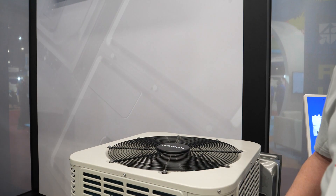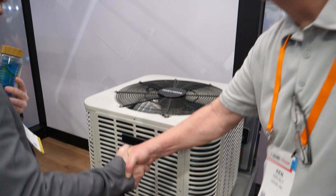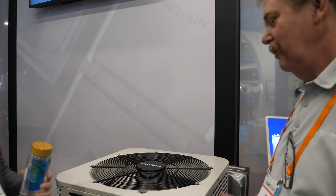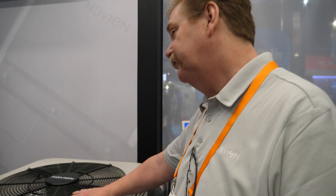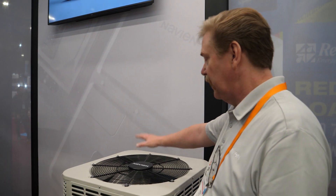The heat pump is brand new stuff for us — we're just starting to get into that. It'll be coming out early next year as our target. With that heat pump, Ken here is actually one of our product managers for HVAC. So this is our new air-to-air heat pump. We're kind of forward-looking — you can see we're building our HVAC product line. This is our first quarter of 2025 launch. The industry is changing refrigerant — we're going with 454B. It's a multi-capacity unit: two to four ton, four to five ton, 17 SEER2, variable capacity.